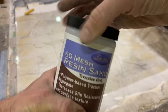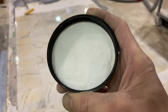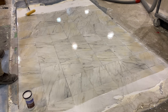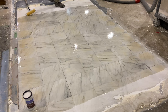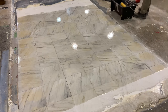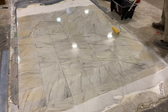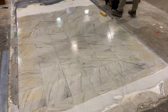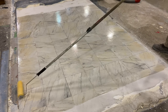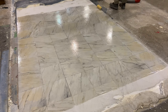At this point a second coat can be applied, but here an anti-slip additive is being added — a 60 grit resin sand, which is basically ground-up epoxy. The amount in the lid is more than enough for the area; it doesn't take much to provide traction. If too much is used, the concern is how difficult the floor would be to clean, since the rougher the surface the harder it is to recover dirt and grease. In the case of anti-slip additive, less is more. The same material is then applied over the additive and dried base layer, sandwiching that dry additive between the two coats, bonding it to the floor to provide the anti-slip surface for wet areas or wherever a glossy top coat might cause a safety issue.